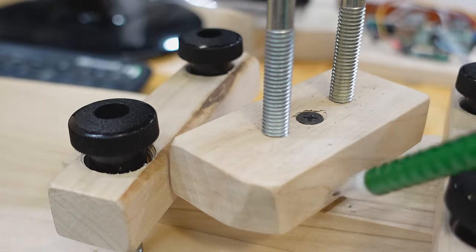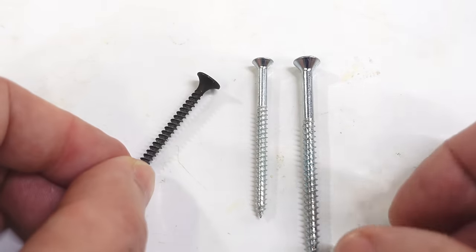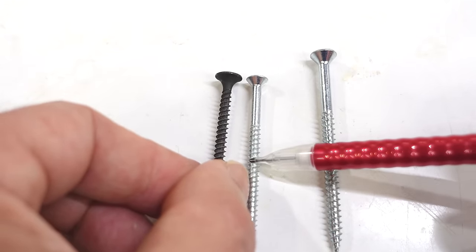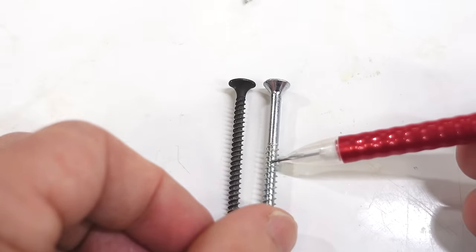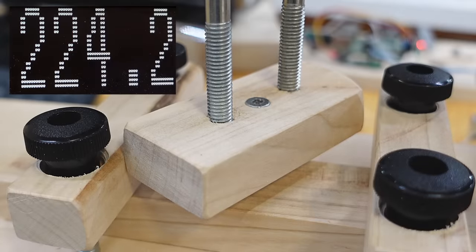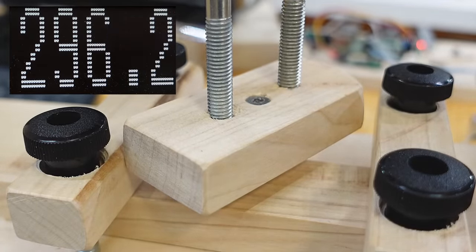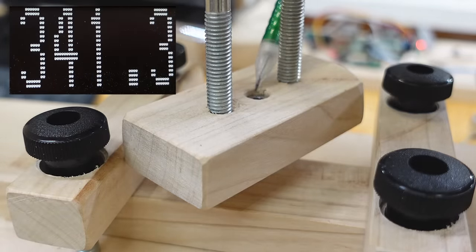We pulled out of the bottom piece here. Now, these drywall screws have sort of a trumpet-shaped head versus a conical head for regular countersink screws. The same size screw as this one would actually be this one, which has got a much smaller head. So instead I'm going to compare it to the next size up of countersink screw — this is the number 8 screw, which has got the same diameter head as the drywall screw. At 264 kilograms it's definitely sinking in.